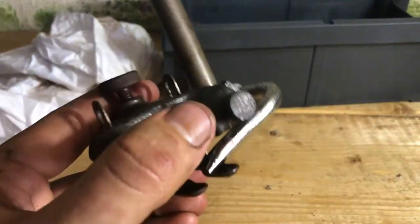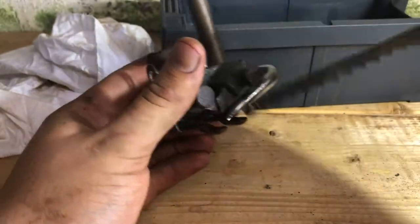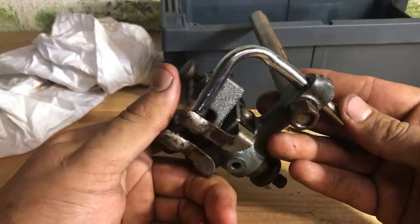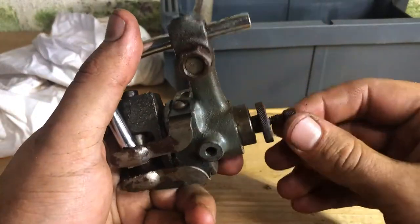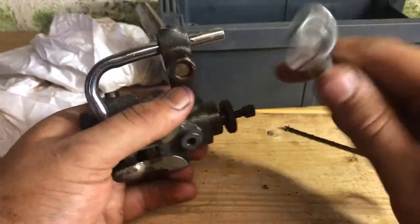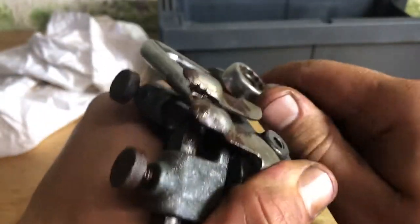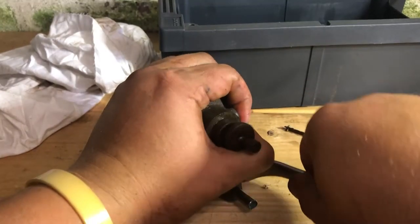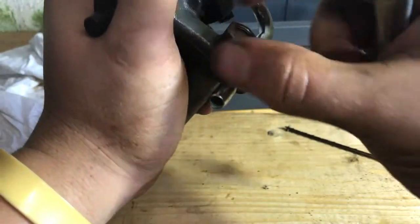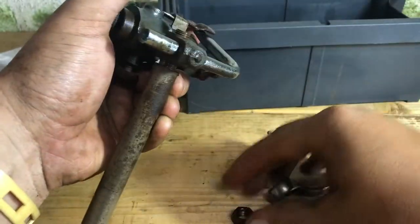There's the chrome-plated copper airline hose with the little blower, and you've got these solid saw blade guides — very similar to a bandsaw. Check the quality out on this: lovely knurled wheels on the height adjuster, cast and threaded into the headstock. Just clarifying — the adjustment rod that goes up and down is not cast, it's machined and has a little keyway that goes into the headstock. Just don't get too excited in the comment section.